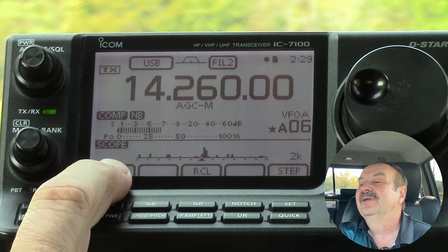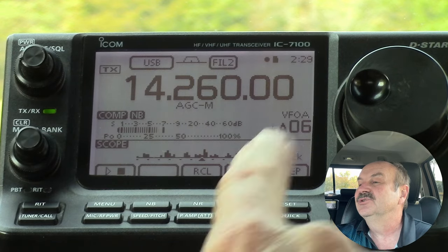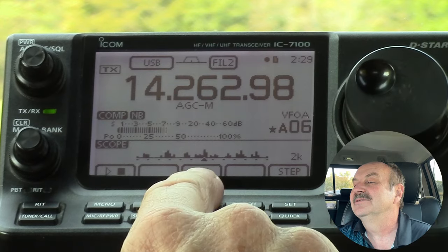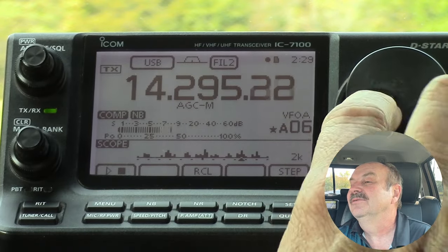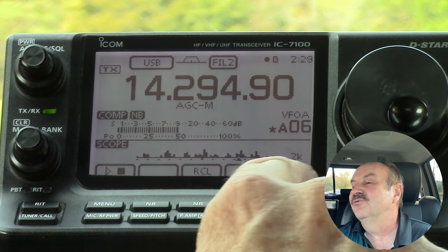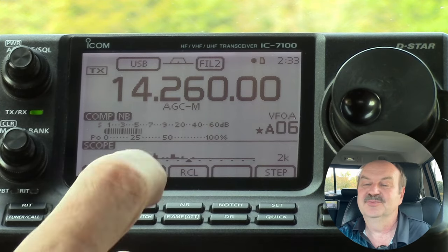So how do you use this scope? Let's find a sweep here with a good strong couple of signals. I mentioned that arrow is in the center. Once I do a sweep, if I start tuning, you'll see that arrow moving. Where I'm on that kind of stronger vertical bar - that's that signal, and he's still talking. Now I'm under this sort of block of signals, and that's at 14,294.90. There's no frequency indication on this line, but you can tell where you are from that arrow. That's how you can find signals - just move the arrow back and forth until you're on one of the spots and you've got a signal.